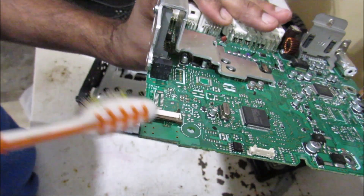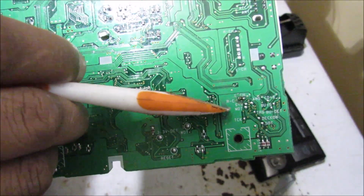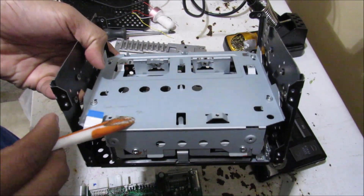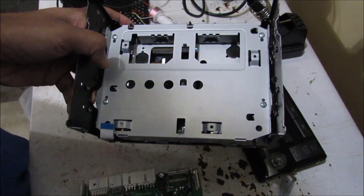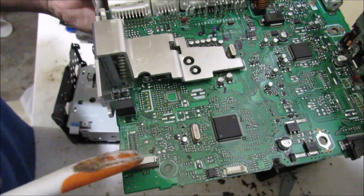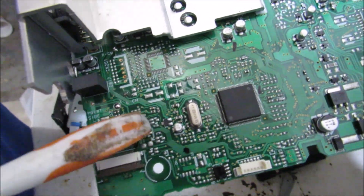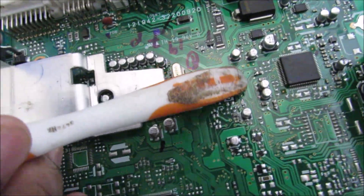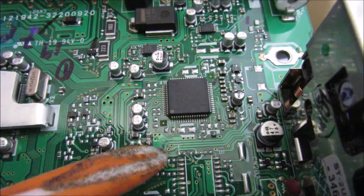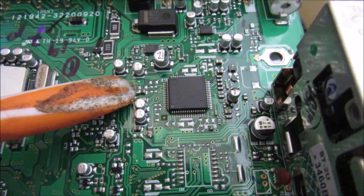That's where the key to this hack is. We're going to be tapping into the CD lines because it's an analog audio signal. If you look closely you'll see left channel, right channel, and of course you can take any ground. This ribbon cable connects over to the CD player. Through some experimentation I found that the initial points are not ideal — they give a little interference. So I traced the connections from the CD ribbon cable through a couple of filters. I bypassed that and traced all the way to the main chip. If you Google this chip you'll find the pinout, which shows that pins 52 and 61, leading to the back of two capacitors, are your CD inputs.